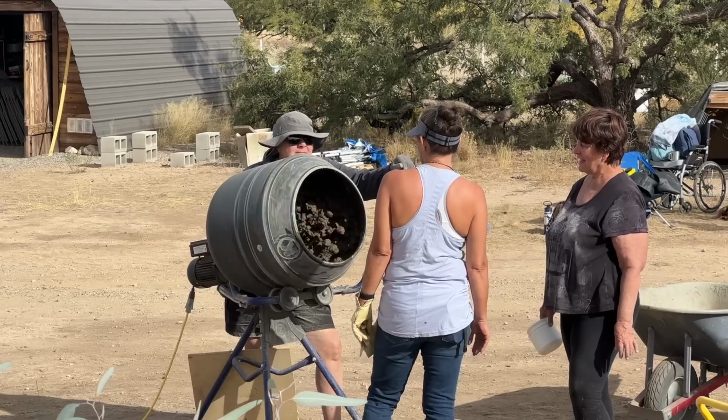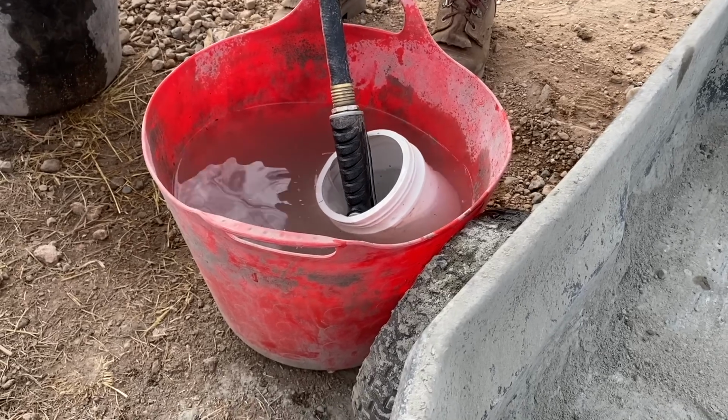Another big bonus is that wood stoves are really good at removing humidity from your space. Yes. Now, if you know anything about earthbag building, it's that when you put the dirt in the bags, you do add moisture, and so you tamp it, and then it actually takes a really long time for that. Like a whole year. Yeah, like a whole year for all of the moisture to sort of evaporate out of these bags. So this will be a really great fit. Not only will it warm the space, but it will also help regulate the humidity in here too. Win, win, win.